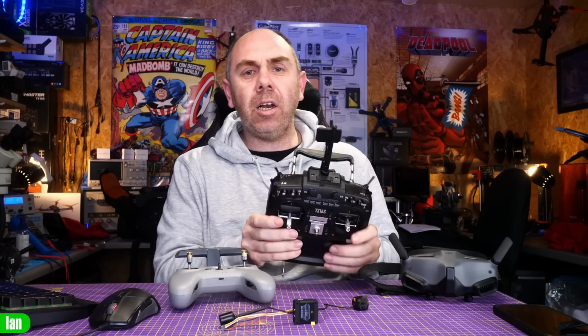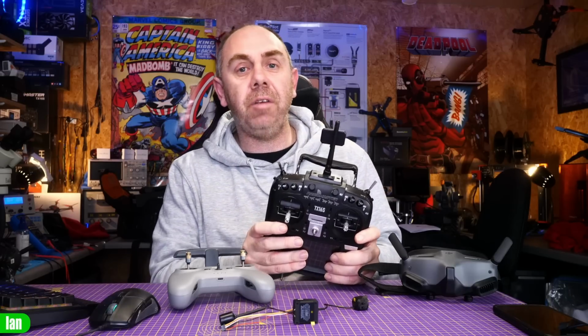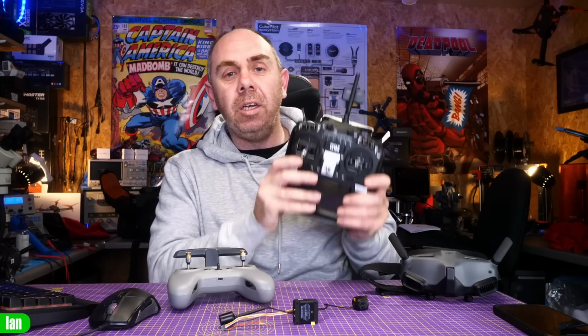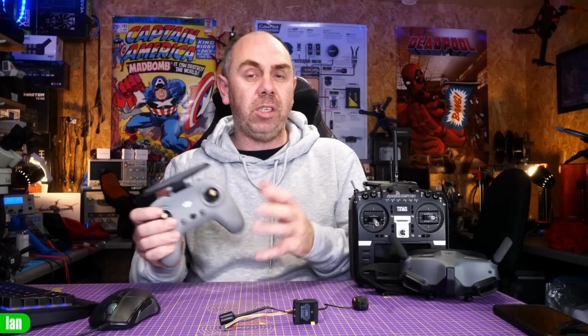And personally, I would recommend you go with a standard remote, something like the TX16S with the Crossfire, with Express LRS like I've got here. Having a standalone RC link means you remain in control. And the real good thing is you remain in control. You have the ability to trigger failsafe and you remain in the situation where your RC signal is almost guaranteed to outperform your video signal in pretty much every situation. So that is it. The behavior is a bit strange, but it is now something you hopefully understand and you can plan what you intend to do with your failsafe settings as a result of this information.